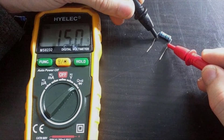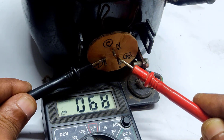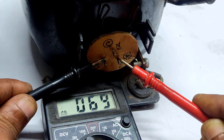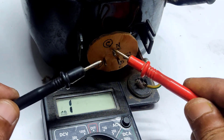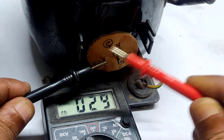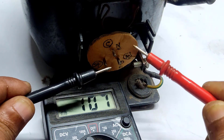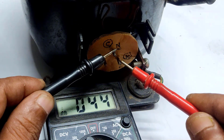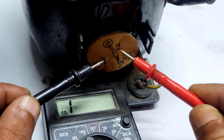This should be verified by placing a multimeter in continuity mode — each time, the resistance between two pins should be checked. I'll check the bottom two pins of this compressor: it shows 69 ohms. Now checking the left-side pin with the top pin: it shows 27 ohms. Now checking the right-side pin with the top pin: it shows 46 ohms.